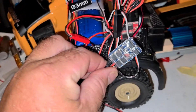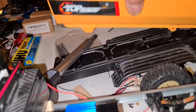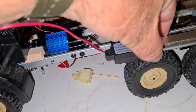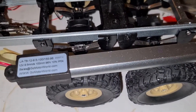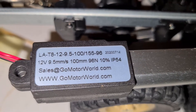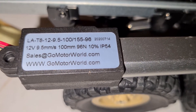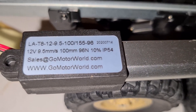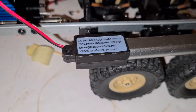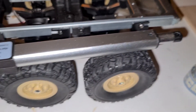This other ESC I've had to put in because I've just got one of those linear actuators to try and use it as a tipper mechanism. I've tried it and it works, but I've just got to work out how I'm going to mount it. It's all the way from our eastern friends — the slow boat from China. It's a 12-volt system but it works nicely; the speed is actually really quite good off the 7.4-volt 2S lipo, and it's smooth and strong, which is what I wanted it for.